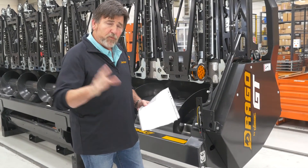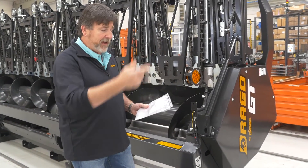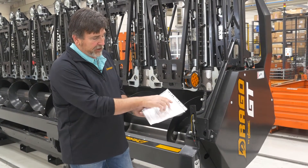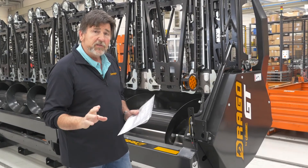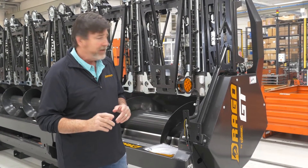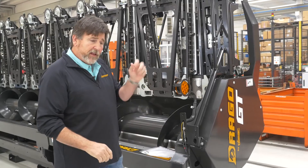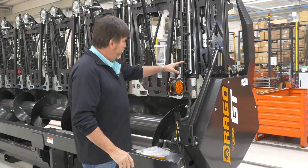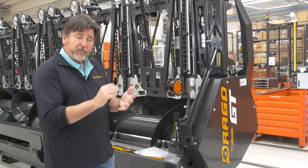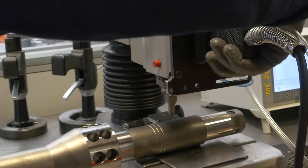Here we are with a Drago that's ready to be loaded and headed to a customer in the USA. It's been through the final assembly, all the inspection points, and the signatures of all the processes done — but that doesn't tell the whole story. What tells the whole story is the tremendous accountability system that OLIMAC has. Whether it's this welded piece here that has a mark and stamp by the technician that ran the robotic welder, or the shaft in the gearbox that was measured, checked, and certified by a technician — with rings that signify what machine made the part and what technician made the part — it's all accountable all the way through this head.